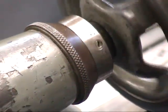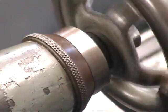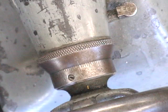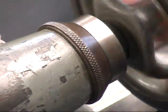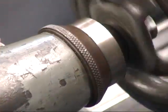The rotational displacement is measured using the vernier on the lead screw. In this machine, we can resolve 1 part in 100 per rotation. For a lead screw ratio of 1 inch per 10 revolutions, this gives a displacement of 1/1000th of an inch per line on the vernier.